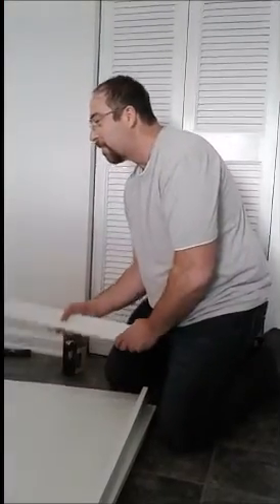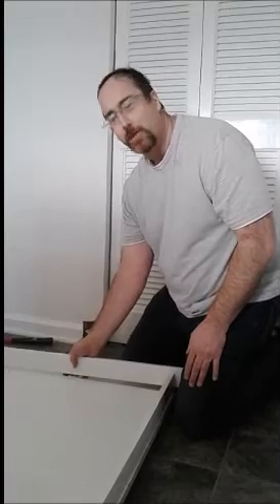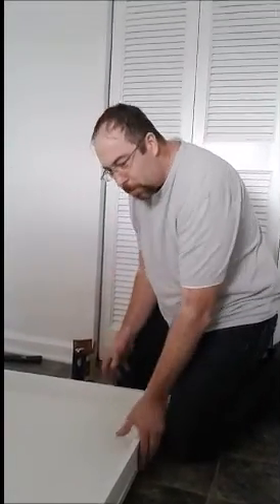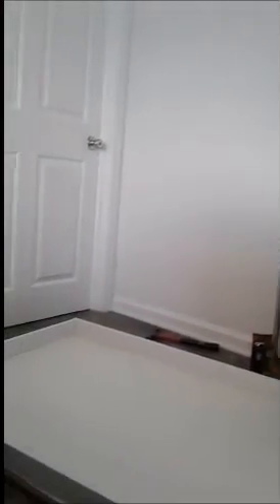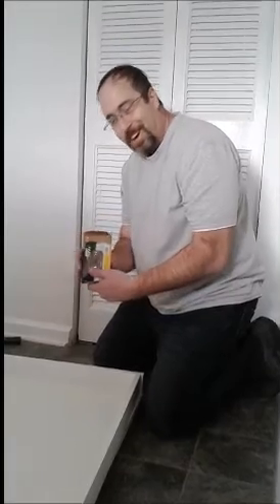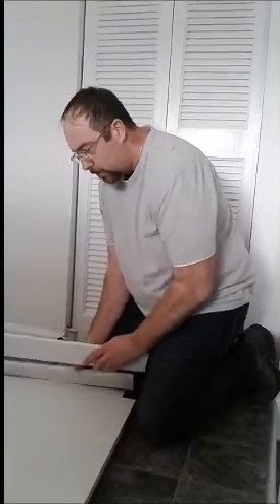Here's the frame — the 1x3 pieces I have pre-cut. What you want to do is measure your window, determine its size, and then make the board just maybe a quarter inch less than the window so it fits in there loosely but tightly enough to cover the whole window. Make your frame the size of the window — the 1x3 goes all the way around. Then take finish nails and nail the four corners of the frame together, then turn the plywood around and put nails through the bottom side into the frame.